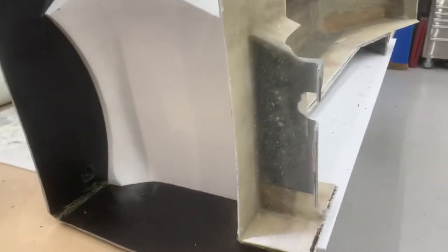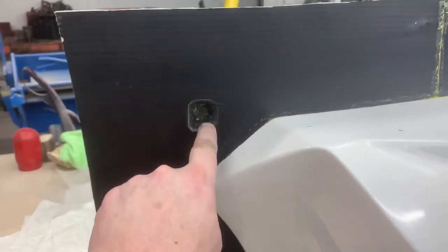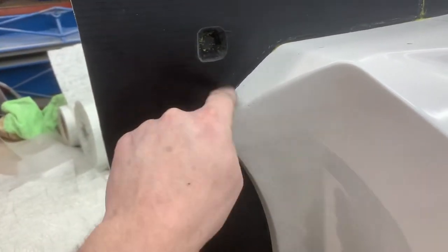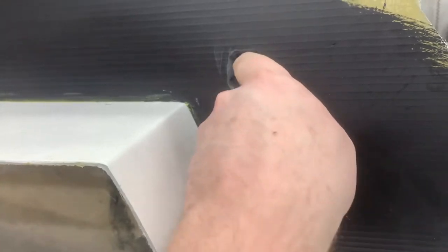I can't really do anything along here, and I can't do the little ones that go around the corner until the two ends are done, so it's slow and laborious. We did have a little bleed-through where we built the mold registration marks, which were built purely out of the yellow mold release clay. There was a little bleed-through underneath the clay so I hammered the little stuff out and filed around the edges.